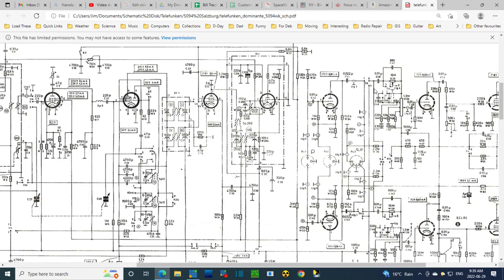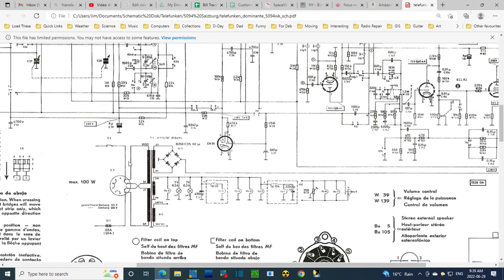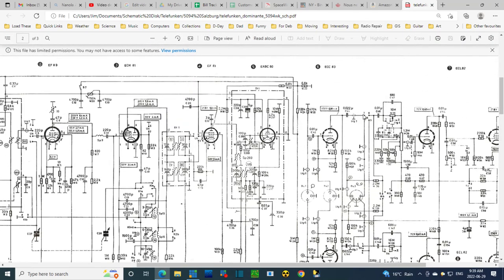So we want to listen to this switch. We want to either inject signals or listen to it. Listening to it might be a good idea. We could put this in the AM radio mode. That will connect 8 to 9. Forget about what's coming out of the receiver. Take my signal tracer and stick it on this number 7 here, terminal. Assuming I can figure that out. Yeah, I guess I can, because this diagram is pictorial over here.